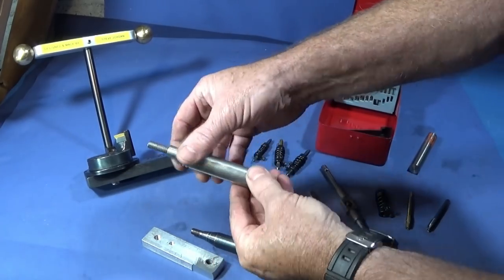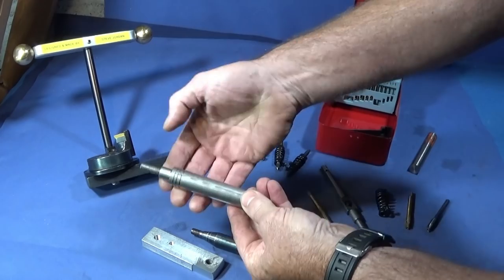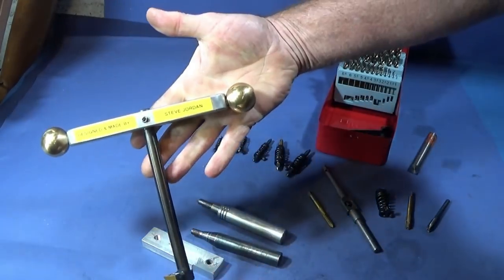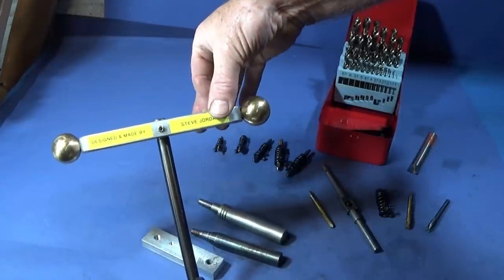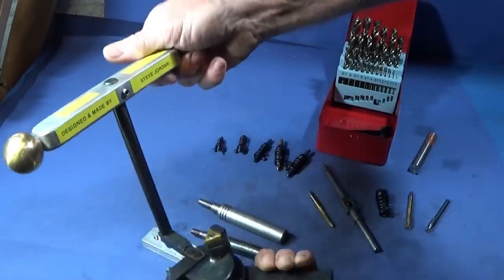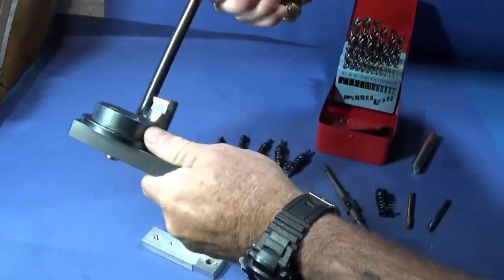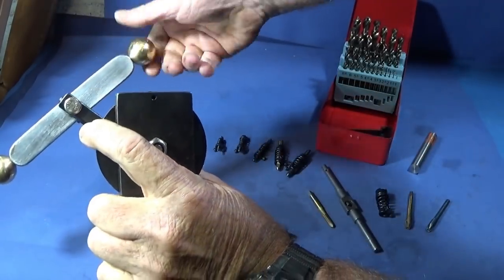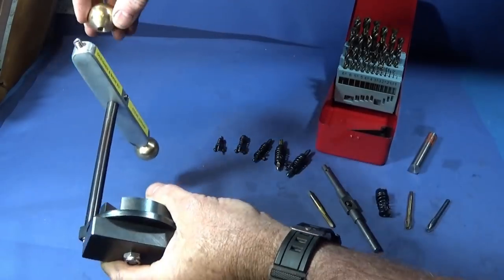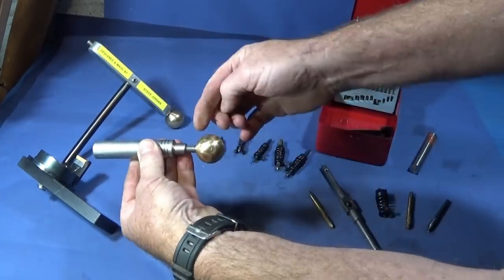I've got the six millimeter and eight millimeter at the moment. Eight millimeter is normally the size for most handle balls. I've made this one here - when you saw it last it just had an aluminium handle on, but I thought it'd be nice to put a ball on each end and give it a bit more character. Plus it's also nicer to operate because you can just hold the balls and do the turning. Most handles, especially on the modern tooling for ball turning attachments, are eight millimeter so they can just screw onto this one in the blank form and then get turned.